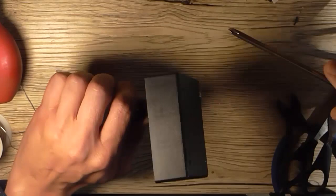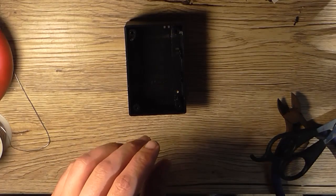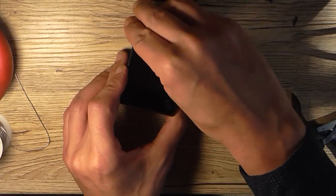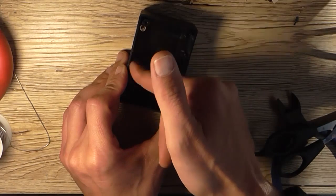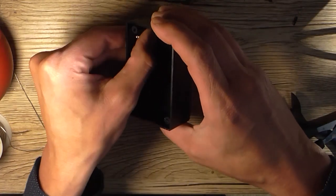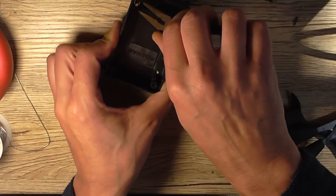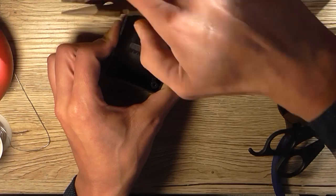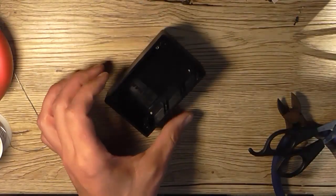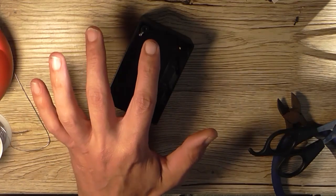Get a pair of pliers, and then we tighten the screw. There we go. And then what they want you to do is grab another M3 nut and put it on top of the first one. And then obviously tighten it if you can so it's not completely loose. Now that's tight. And then they want you to get an M3 tapped 15mm long spacer, and that should give you roughly 19.5 up the case.